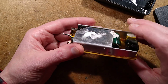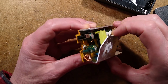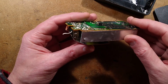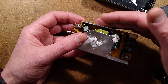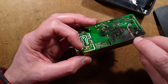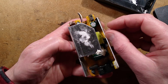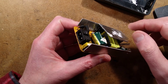What other routes could have caused this? It could have gone via the transformer — that's a common failure mode. There's the output diode, though that's a plastic case diode. Another possibility is that metal heatsink fins came in contact with something else. It almost looks like there's a bit of splatter, and there is a little skid mark at the bottom here, but I don't think it's near any of the low-voltage components. The transistor in here is also plastic.